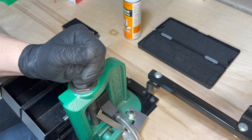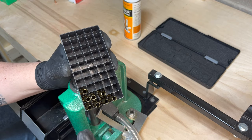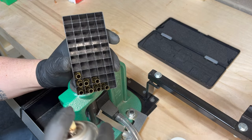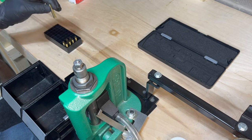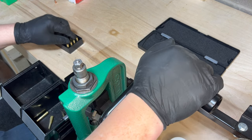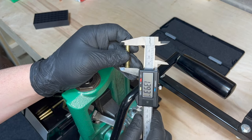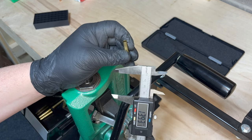You'll just want to be right above or just touching the case, then lock it into place. I'm a bit frugal so I like to reuse things — here are my Hornet cases. I'm going to give them just a little shot of Quick Slick case lube, place this into the shell holder, run it to the top, and now you have a fully resized, de-primed 22 Hornet shell. The trim length was 1.393 inches and it looks like the case doesn't need to be trimmed, so now we can get ready to reload.